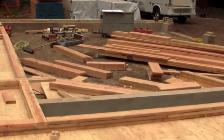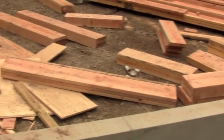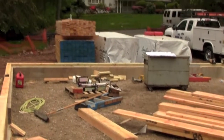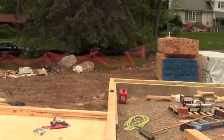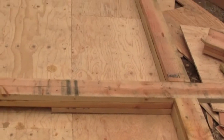These are all the sides of the door openings and the window openings, so they'll have those all cut out and ready to go. Then they bring over the two-by-fours — they're pre-cut for a nine-foot ceiling here. They'll lay them all down where the marks are, pull off the two top plates, and start nailing them together.